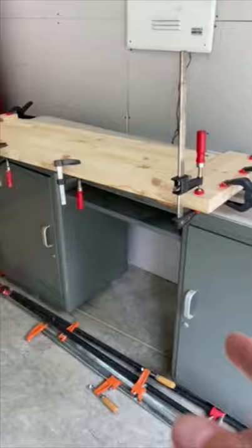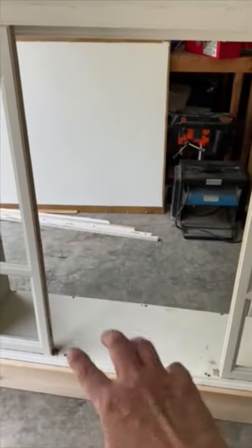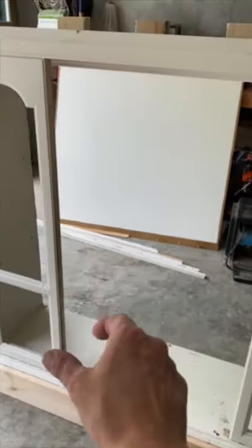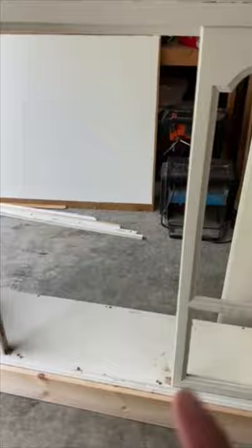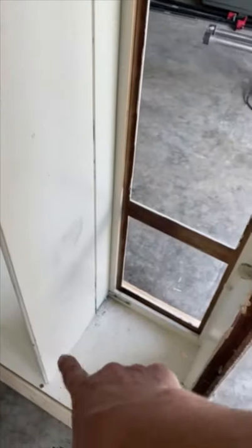While this is over here drying, I just realized there's another thing I need to do. This is the open part where the fireplace is going to go — where the actual fire is going to go — so I need some sides here, something on this side and something on this side, so that the faux fire is in the middle. Fortunately I have these shelves that were in the top of the hutch. I'm going to take one of these, cut it down to size, and plop that right in there to make my sides. I secured them in here with brackets down in the corners and up at the top.